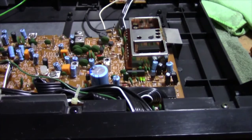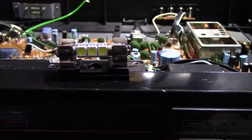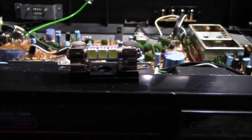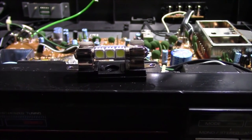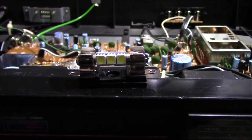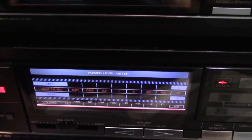The bulb isn't working, but it's working just fine otherwise. This is the style of bulb I decided to try — it's a fuse-style bulb for automotive applications, good for up to 14 or 15 volts. That means it should work — it might actually work perfectly fine with the cassette deck because I think the cassette deck is 16 volts.